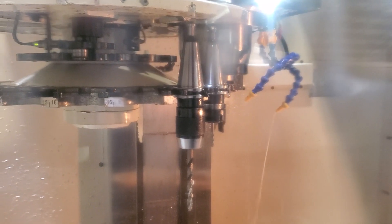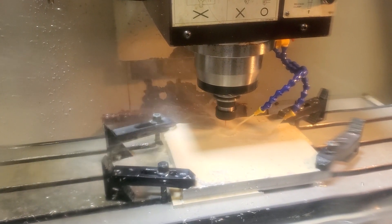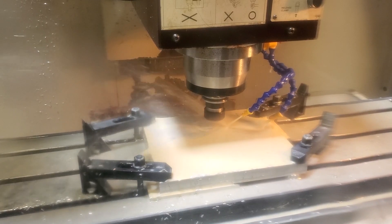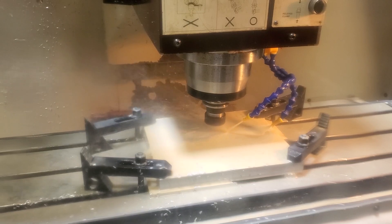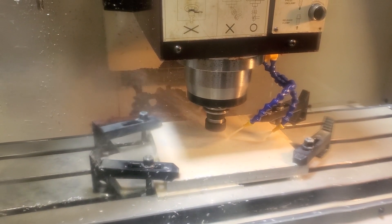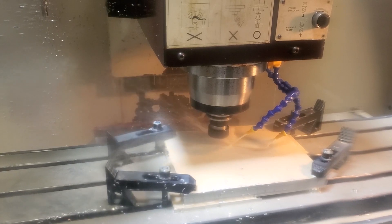That'll give us a 5 to 1 mechanical gearing up. This is necessary because off-the-shelf generators usually run at a higher RPM than what our turbine will be putting out. We expect our one kilowatt prototype is going to be putting out somewhere close to a hundred RPM in about a 23 mile an hour wind. So we are giving it a 5 to 1 gearing up so that we can spin the generator at the RPMs necessary to produce power in the range that it is most comfortable.